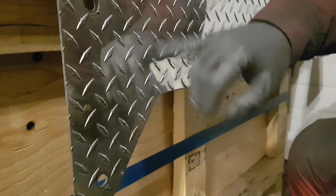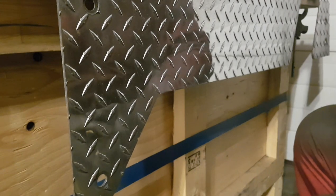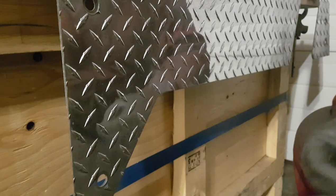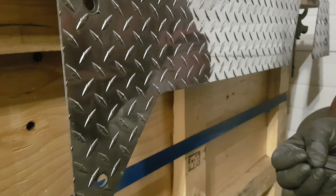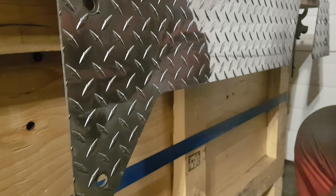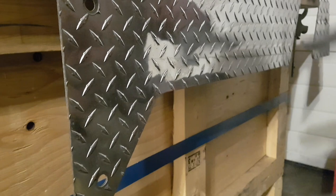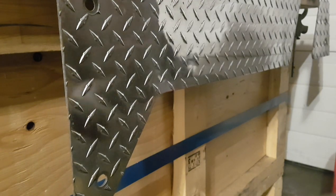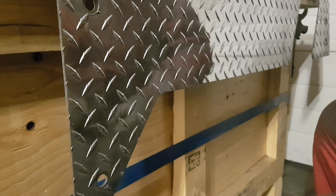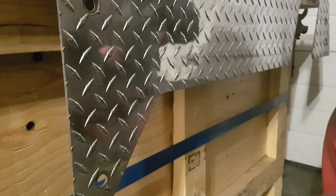The other thing the yellow will do is if we did miss some spots, and maybe went a little too fast or didn't spend enough time, it'll still cut those out, but at the same time, we're still gonna get the gloss out of the yellow. So I'll go ahead and cut this piece with the yellow pad, an intermediate cut, and then we'll go from there.